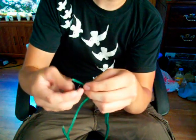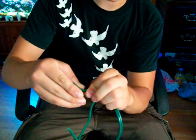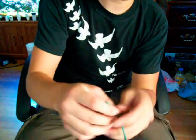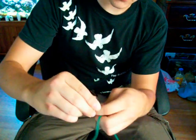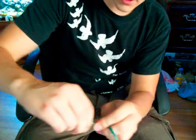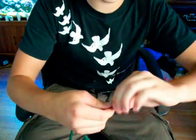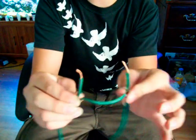Now you're going to splice off the end. If you have wire strippers you could use those, but a razor blade works fine for me. You're just going to pull it off like that so you've got some bare wires showing. It really helps to use a super sharp razor blade because it cuts through like butter. Then you just want to twist these up, make them nice and solid so they don't fray apart on you. Now it should look something like that.